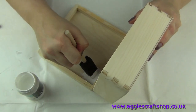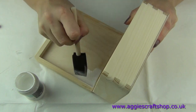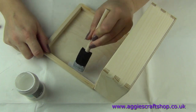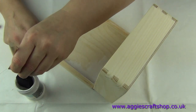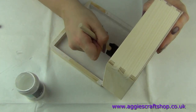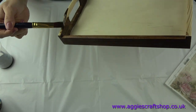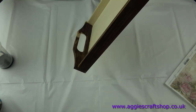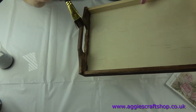If our plan is to do a shabby chic finish, we need to apply two separate layers of paint — one on top of another — and then remove some paint by either sanding or scratching to create a distressed look. At this point we should have a plan for which color goes on top and if it's light enough to glue a thin napkin on top. Sometimes we use wood stain, but we must remember that we cannot glue on dark surfaces, so planning ahead is crucial.